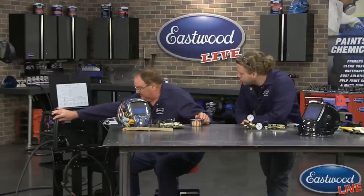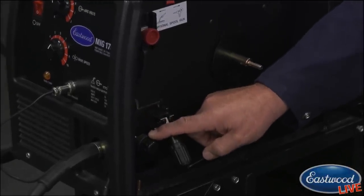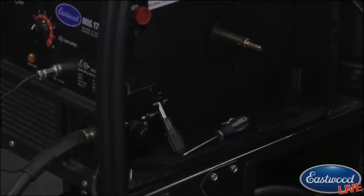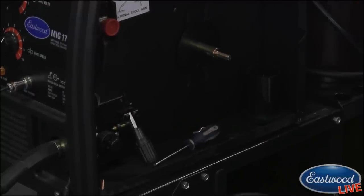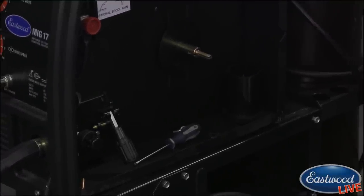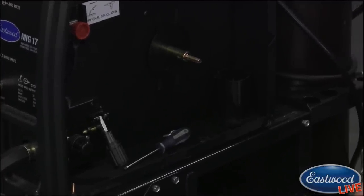When you load the wire, when these machines come new there's a coating over the drive roller — which is metal — and the counter tensioner roller, which is also metal. I take a little bit of low-VOC prep on a rag and clean the oil off. Every roll of wire I put on, I clean those rollers too, because they get dirty from the coating on the wire. Just keep them clean — not lubed, just clean — so you have a good, clean drive roller for smooth feeding, especially when doing spot welds on sheet metal.